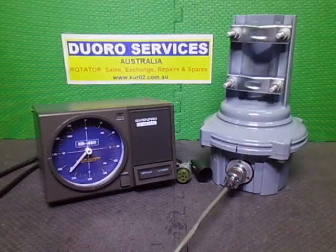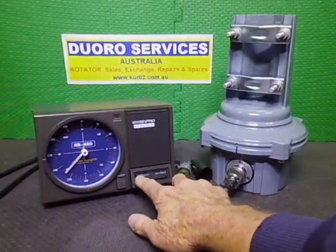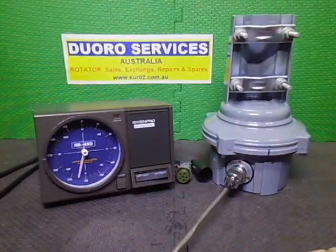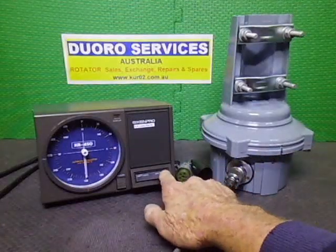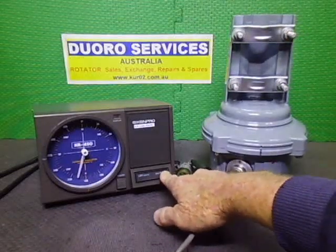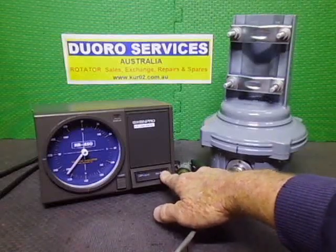Okay, we'll go around to the left to start with, and the limit switches, now if the limit switch is in, it will take over when it reaches south. There we go, so no more stuffing up motors and whatnot. And now we can go momentary or lock with this particular controller. So that's just a momentary hold at the present moment.